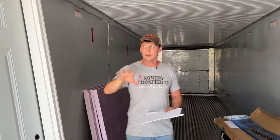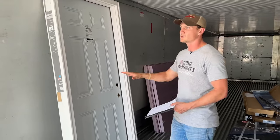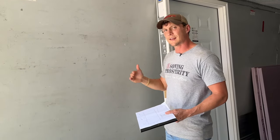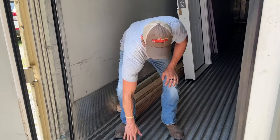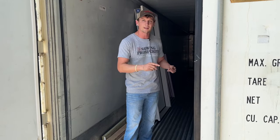The front section will have a full wall with a door in it, very heavily insulated. This one will not be hooked up to a CoolBot — it's just an air conditioner. All three air conditioners will be cut out with exhaust toward the back. We're going for about 64 degrees as the lowest in this section. When these doors close, there's a gap that will have plenty of insulation, and that's going to help us get that extra insulation even when the doors are open. Let's go through some of the products we're getting beforehand, then we'll show you the build-out.